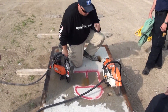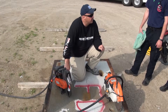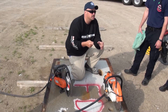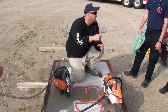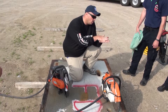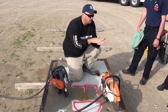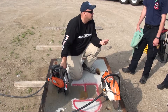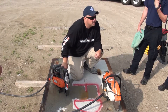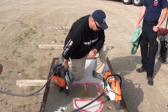When you're running these saws, run them wide open — that's the first thing. For the water mixture, think about when your kids make chocolate milk and just keep dumping the chocolate powder in until it's thick and nasty — that's the consistency of water you want. If you have too much water, it creates a layer between the concrete and the blade and you won't actually be cutting. You want just a little bit of that thick milky substance coming out the back. If you're seeing powder, you don't have enough water. If you're seeing clear water, you've got too much.